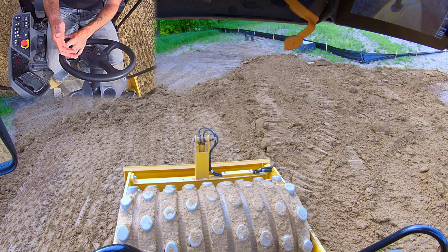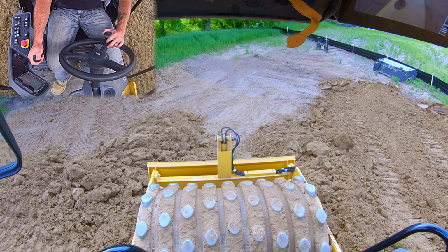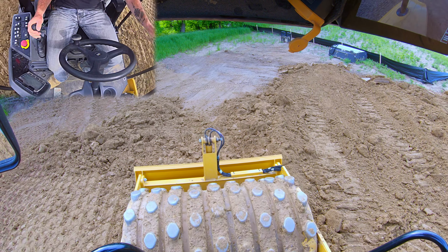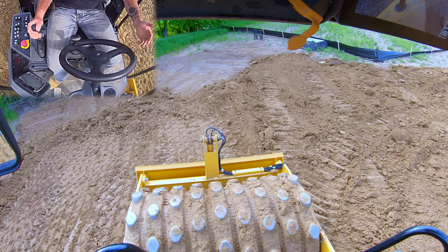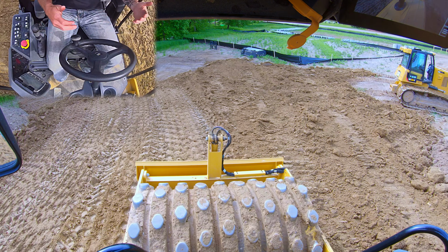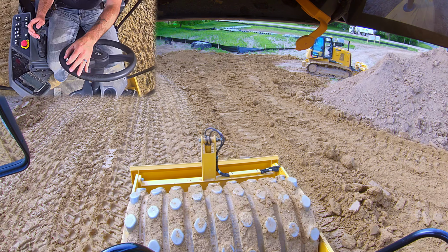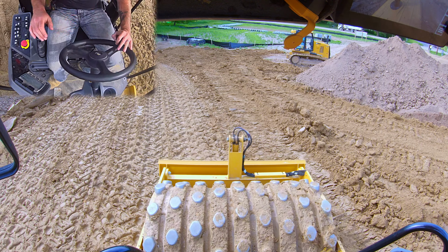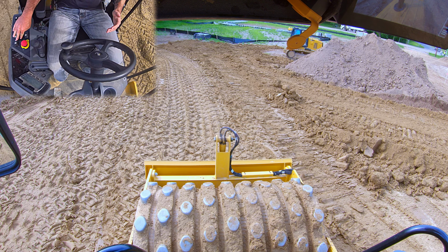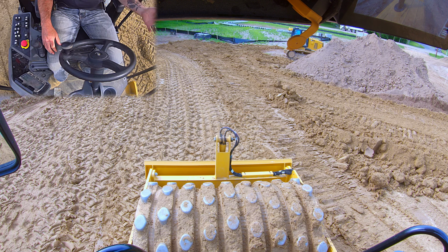And then what would happen is you have your proctor guy come over, he gives you a density test. And from there, you're going to kind of get a feel for if that pattern works for you, and if you get density, great. That's the pattern you use for the rest of the job. If you're not quite there, you may have to come back, and you're going to work with your proctor guy, and he's going to help you figure out when you've got density. And mentally, you'll know, okay, I need to roll it in this pattern, going back, forth, back, and I'll get density. So generally speaking, in a very quick crash course, that's how to efficiently run a roller, stay out of everyone's way, but get the job done.